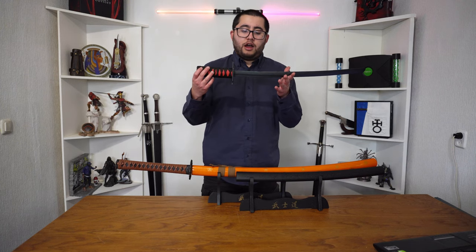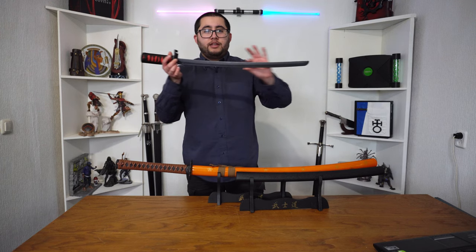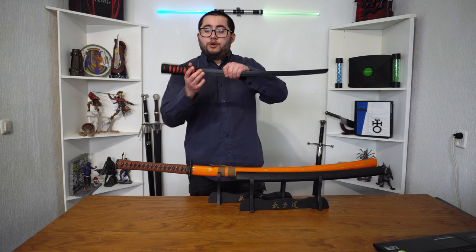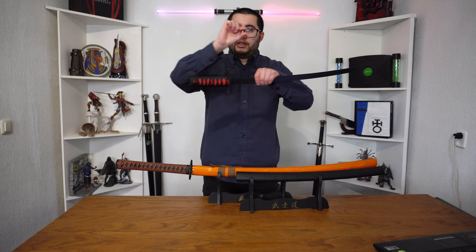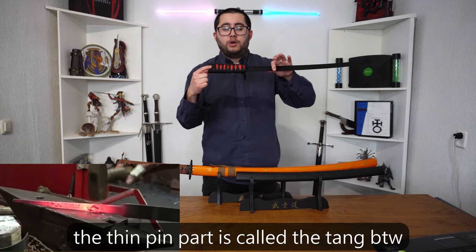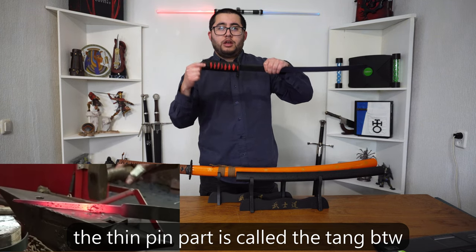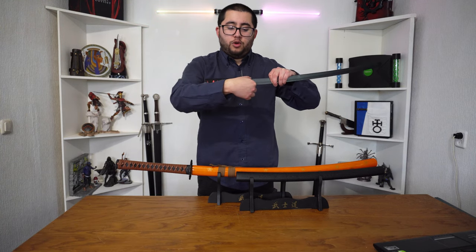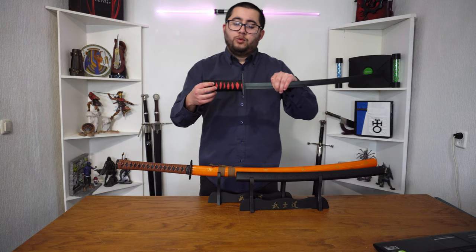There was another thing that made this katana really weak. Usually you've got the blade, which is basically a slab of steel, and you hammer down the end of the blade to make a thin pin that goes inside the handle. Now this one wasn't forged — it wasn't hammered into shape, it was ground into shape. So you actually get less steel there, less dense steel than you normally would, which makes it really weak at that point.